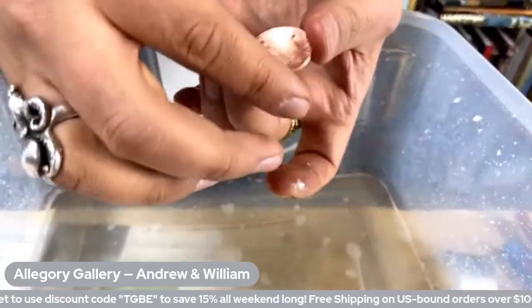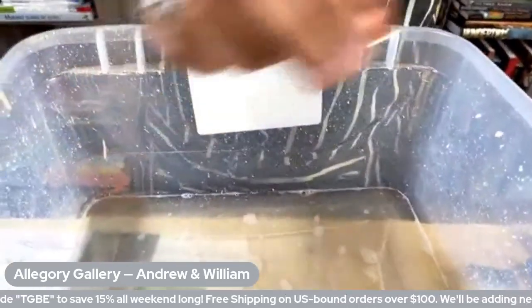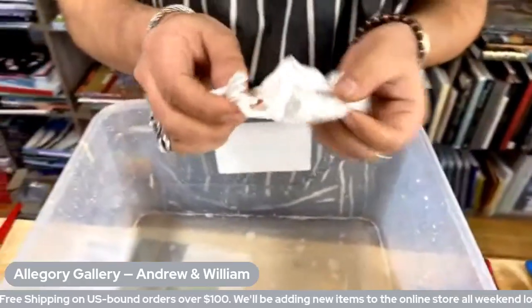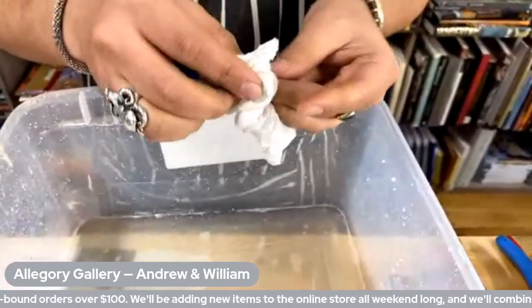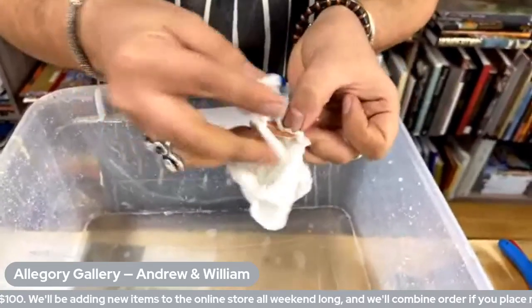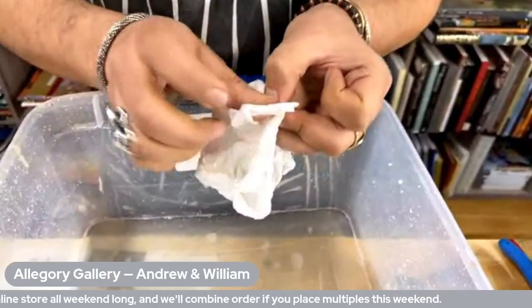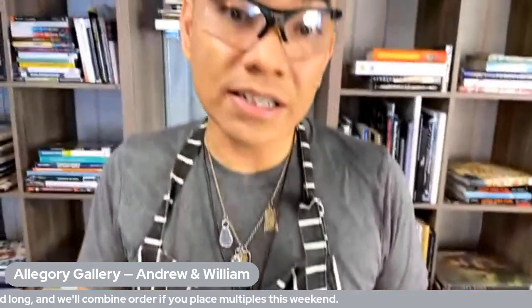Well, if it looks dirty, it's probably dirty. But also, if you put a little bit of water, the water should sheet off of the metal. If it beads up, that means there's an oily surface on your piece, and that is the opposite. It's not your friend, because then you're going to be like, how come I got a fingerprint? And then it's like, I told you, clean the stuff, but you didn't listen. You didn't listen, so you're going to do your own way.